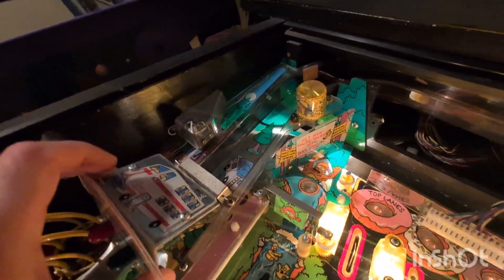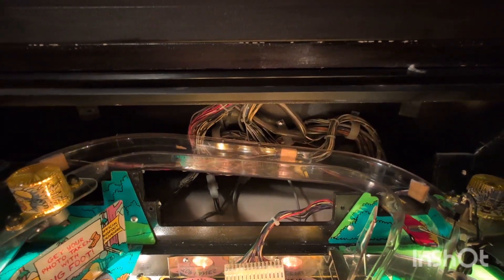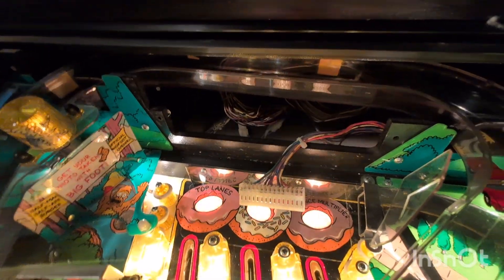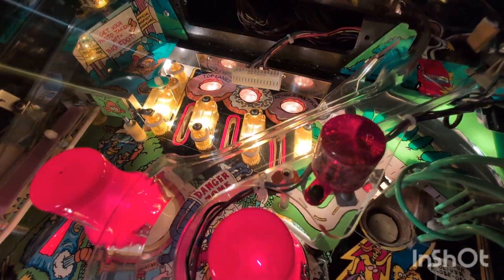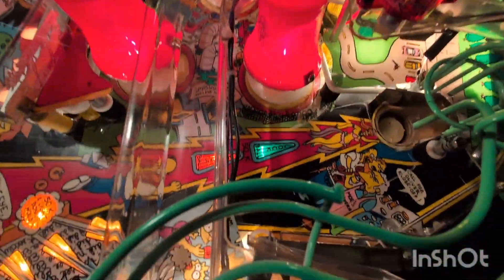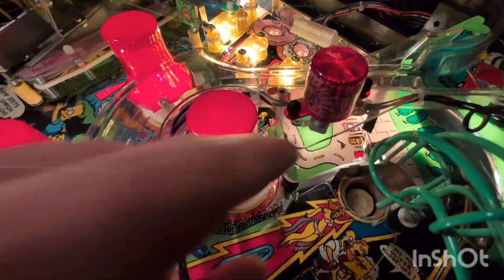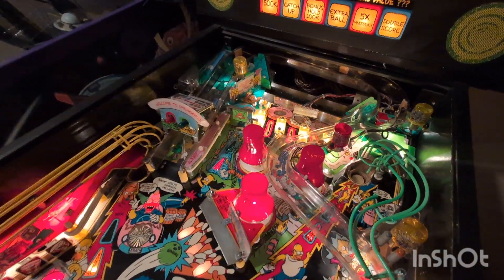Everything is kind of loose now — there were just the two flap screws there, and nothing behind the back panel. Be careful when you're raising and lowering the play field; my ramp really hits those back wires. So with everything loose, just make sure you're not going to rip the wires out or bend your ramp. Over on this side there was a mount to hold it down, and there's another mount by the railing where I need a spacer — mine's missing. There's a ball trap guide that will need to be riveted, but it's nice that the flasher domes are just screws instead of rivets. I'll have to take this out, get the decals off, put the wiring over, and refit the new ramp.